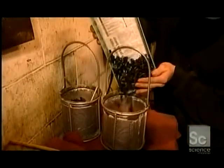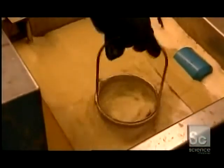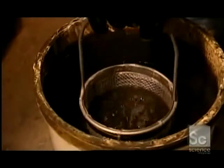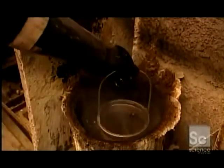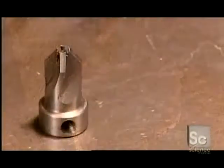After cooling in warm water and oil for about 15 minutes, workers submerge the tools in an industrial strength cleaning solution that removes all the oil grit. Then a bath in acid to remove soot from the oven. Then finally, 20 minutes in a blackening solution, the ingredients of which are again a closely guarded company secret. This last step is purely cosmetic.